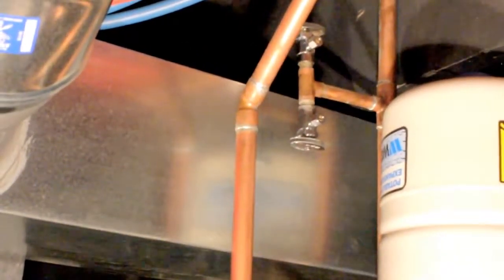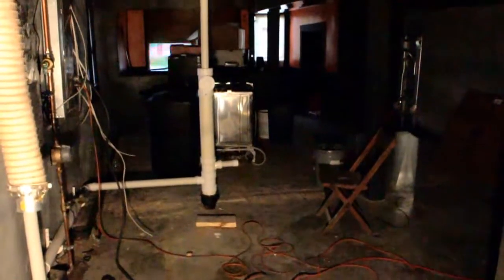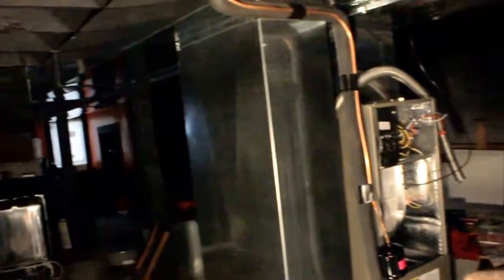Nice. That's pretty much all of the plumbing, right? Sure. Of course, that vent over there, that stack over there, that vent goes all the way out the roof on its own too. Which is 2-inch all the way up, because you can't run 1.5-inch vent out of the roof. It's illegal. It has to be 2-inch. You can actually run that 1.5-inch all the way up into the rafters and then bush it from 1.5-inch to a 2-inch, as long as the 2-inch goes through the roof.